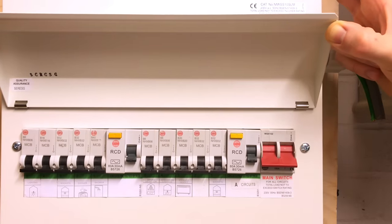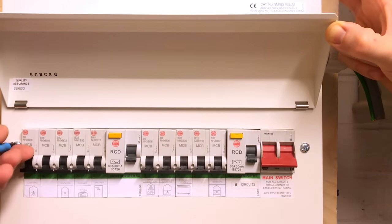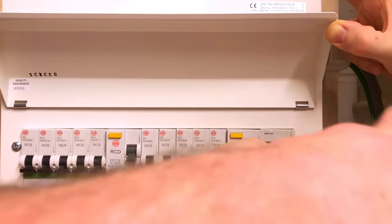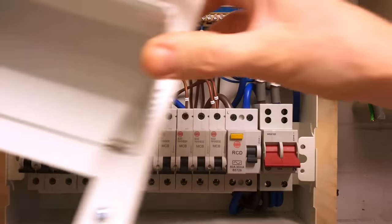In this mimicked installation we need to get inside the electrical enclosure, and an electrical enclosure can only be entered by means of a tool or a key. In this case we're using a pozi screwdriver to remove the fixing screws, and once those are undone the cover can be slid off the front.